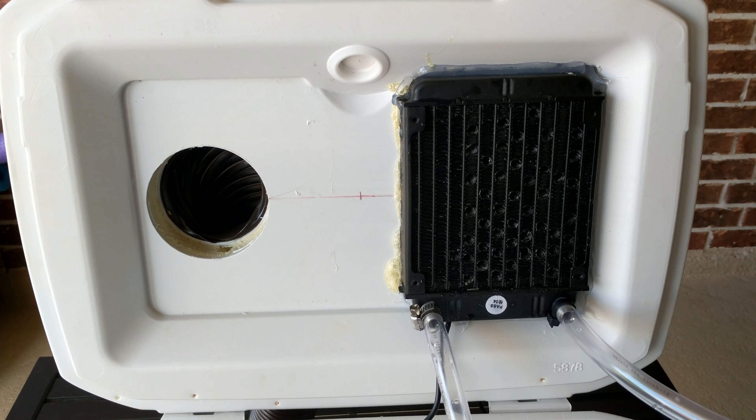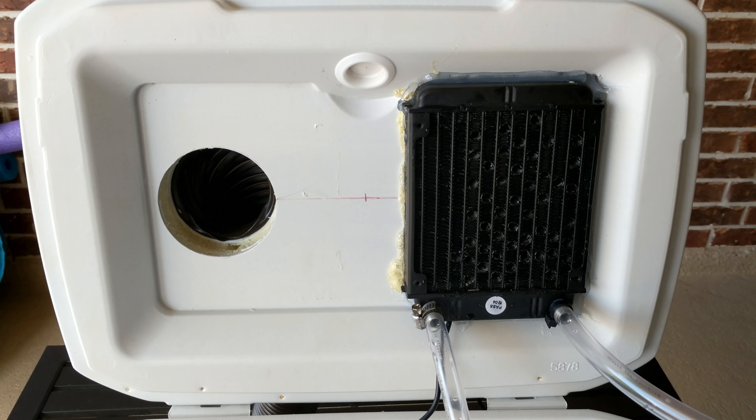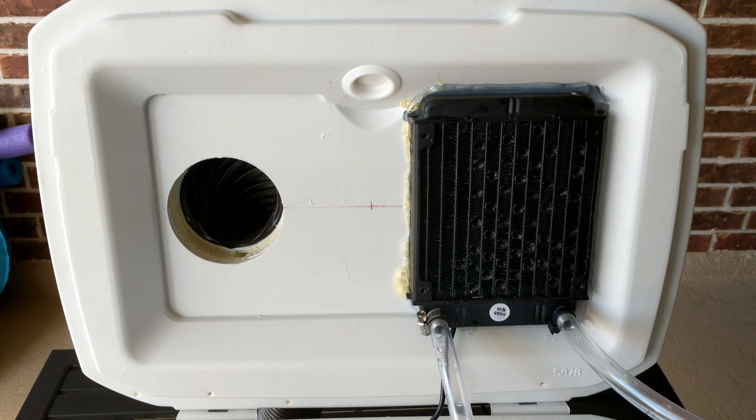So after about an hour of use I'd get zero airflow. So I mounted this on this side so that the fans would push the air through, but that still wasn't quite enough. So what I ended up doing was enlarging the openings through the radiator. By doing that I lost a little bit of efficiency, but I'm still getting the air down 30 to 40 degrees below ambient. It's working really well.